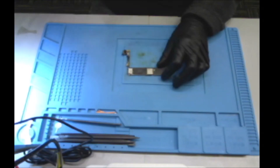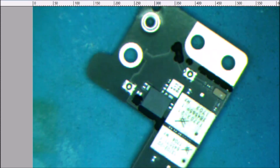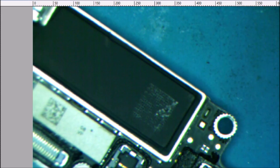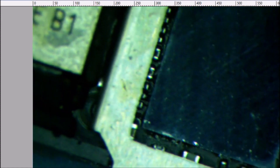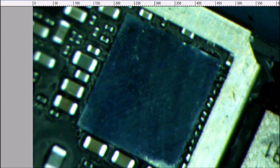Let's see if we can take a look at our old work and learn something new and fix it again. I can still see my tracer wire there, so that looks like a good repair. But if audio is not working then we need to do it again. This time I'm just going to replace the chip and not reball it. Let's get started.